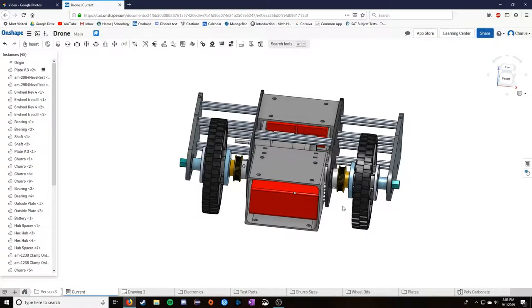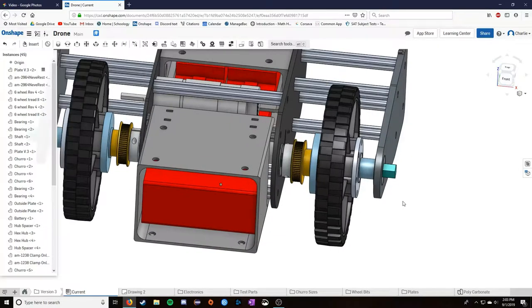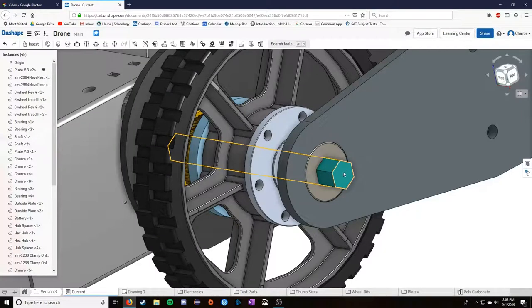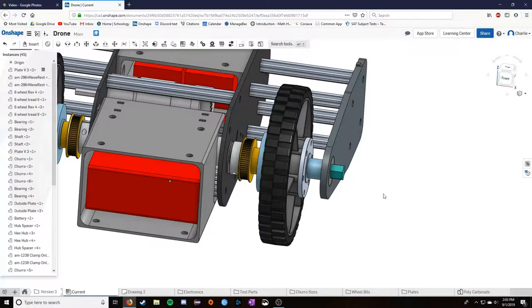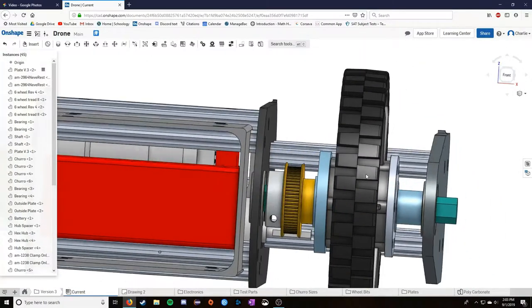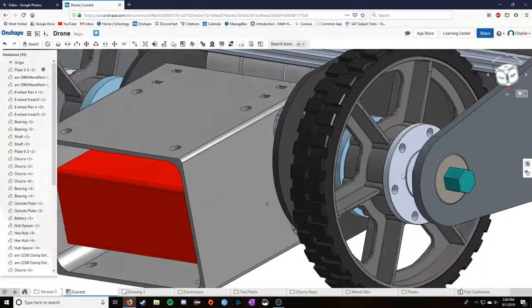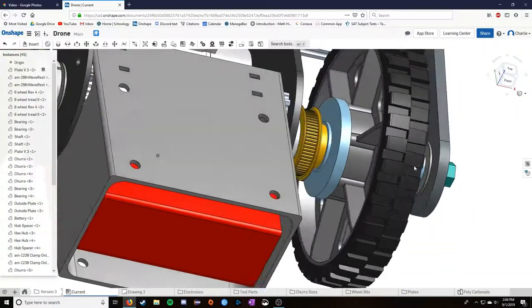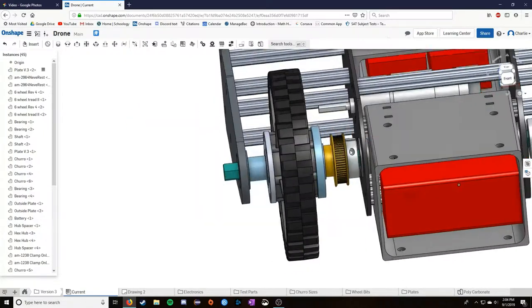So talking about driving motors indirectly, you can see these wheels are a lot more complicated than they were the first time. Originally, they just sat on the shaft and that was it. Obviously not the case anymore. I'm using this stuff. This is half inch hex shaft. This is used in FRC, the larger weight class of robots for FIRST challenges. And it's running between two bearings here, and with these stacked up elements. There's bolts that go through here, you'll see in the actual live videos of this robot. And it's all held in place.